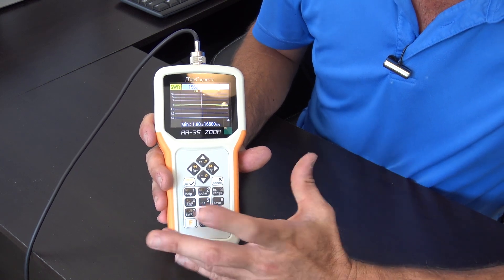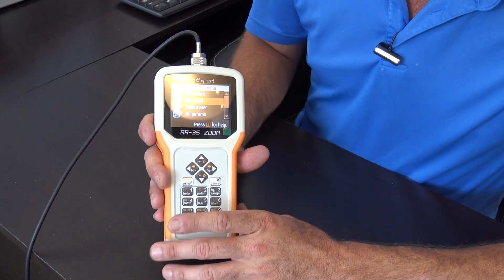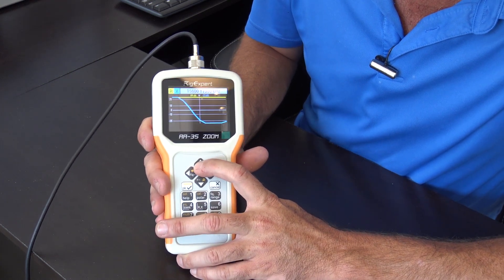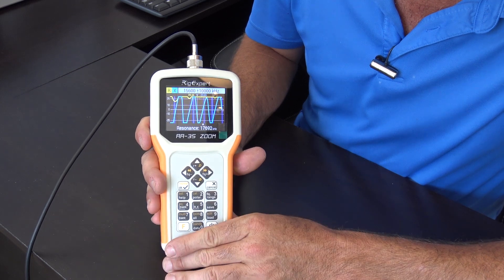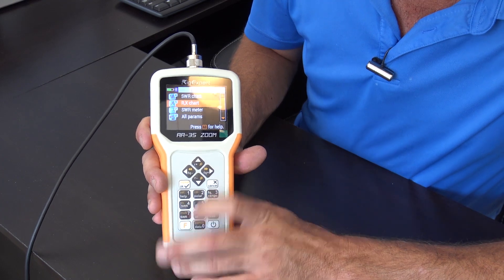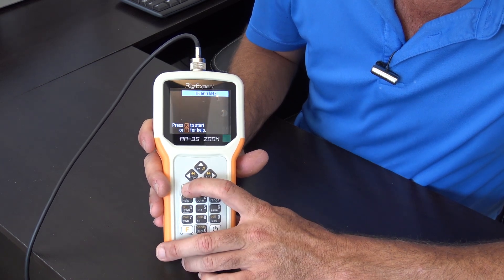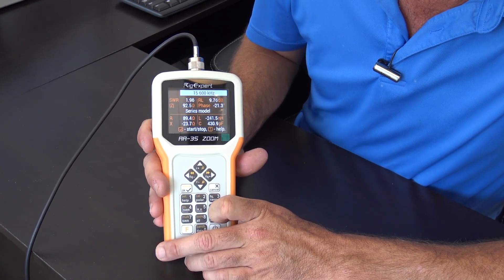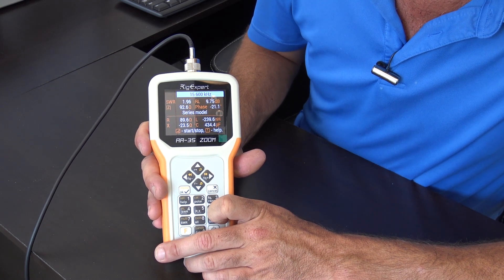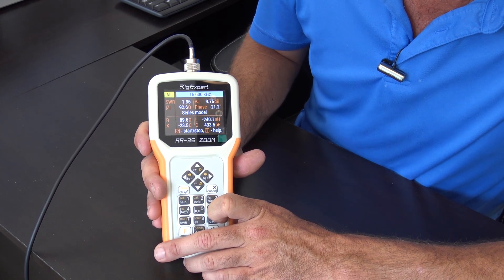It's very useful for plotting a multi-band antenna. If you want to check resistance and reactance, you can do that with the zoom function enabled as well to see exactly the resonance and the values coordinating with it. There's also an All Parameters mode — hit Start and it will show you everything at one snapshot: SWR, reactance, impedance, return loss, capacitance, inductance, and more, all at once based on the frequency you pick.